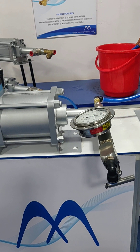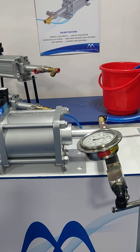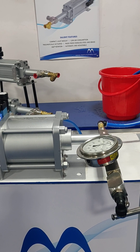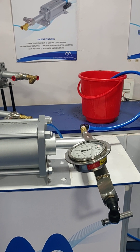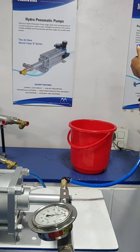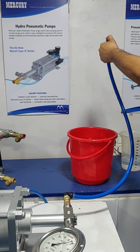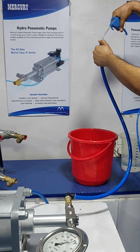In case of smaller plunger pumps like 10 dia or 14 dia, sometimes just filling water into the suction line does not help. So you have to give some air pressure after the water is filled. Take out the pipe from the bucket - we will see how to do that. Fill the water into the pipe first. If that water does not go then you have to pressurize it from the top side. You have to apply some air pressure.